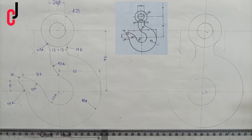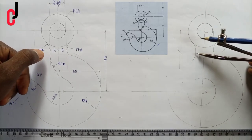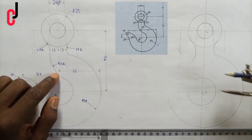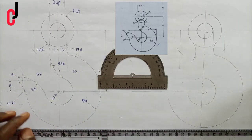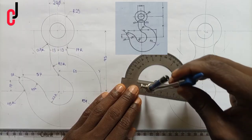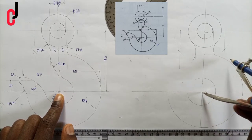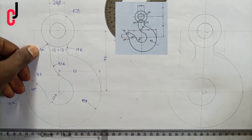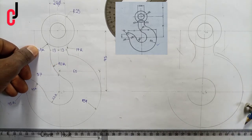From our diagram there's an arc of 43 millimeters touching this circumference externally and also touching the other circle externally. It touches this circle of 22 millimeters externally, so we add 22 plus 43 to give us 65 millimeters. We place our compass at point 01, pick 65 millimeters, and scribe an arc. Next, this 24 touches the 43 millimeter externally, so we add 43 plus 24 to give us 67 millimeters radius.